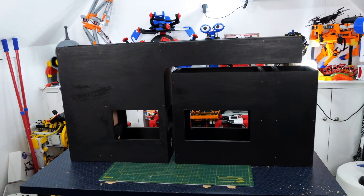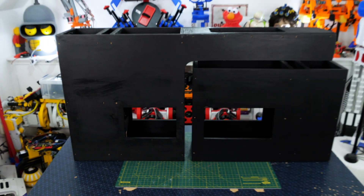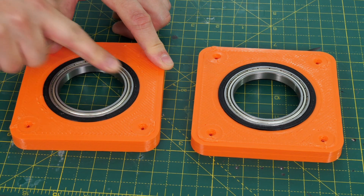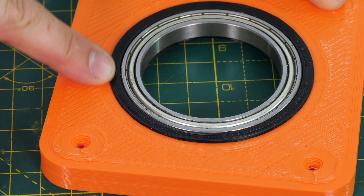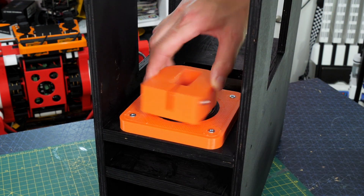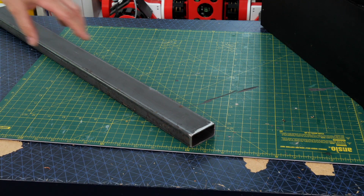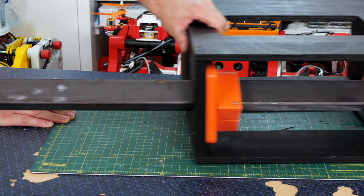Right, let's get this bike together. I painted it black again to match the wheels, including the inside where I could reach. I've printed bearing holders in 1.2mm nozzle with an internal part in a finer nozzle to tolerance it — a really good tip. Those bearings fit on the internal parts and I've got a clamp for a 50×25 piece of steel that fits on the internal bearing. I'm putting a piece of steel through as a square axle into a round hole, clamped with bolts so it allows it to rotate properly.